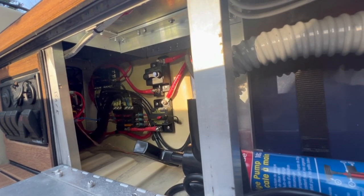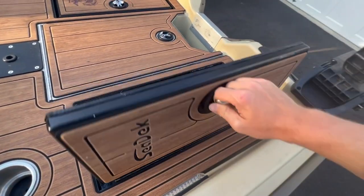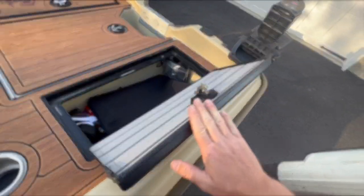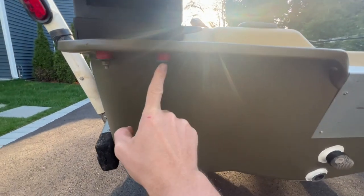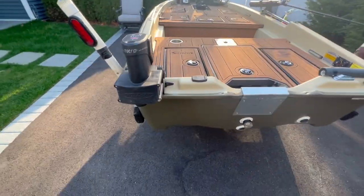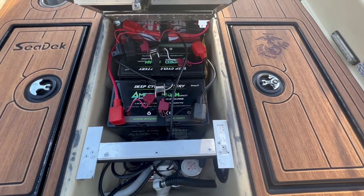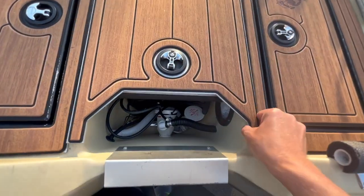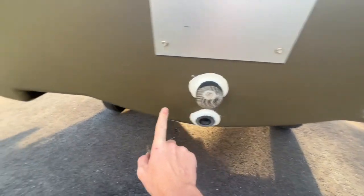To the right, he has safety equipment like an emergency bilge pump in case all the electric fails, and his charger back there. He got rid of the stock back hatches and dropped in new ones. He used bushings — specifically skateboard bushings — to attach all the major components, including his trolling motor and micro anchor. In the middle compartment where the gas tank would have gone, he made a special standalone hatch that fits the battery box completely. Down there are his bilge pumps and aerator pumps for his live well.